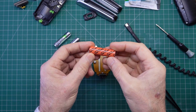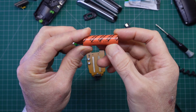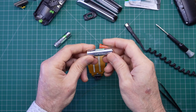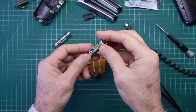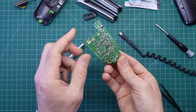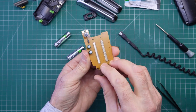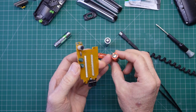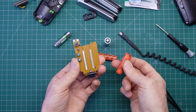The capacity of these old cells is 1,600 — I'm assuming that means 1,600 milliamp hours. These new ones being 2,300 milliamp hours, they're going to be a significantly higher capacity, which is great for using the shaver longer between charges. But does the charging circuit on this printed circuit board allow us to actually charge a 2,300 milliamp hour cell? We'll find that out. The slots are quite wide, so I might be able to get some thicker nickel strip through those slots to fashion new tabs.